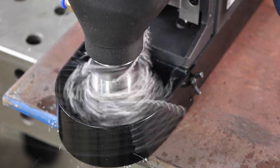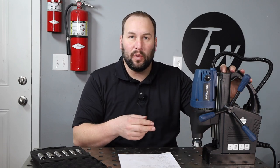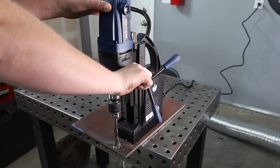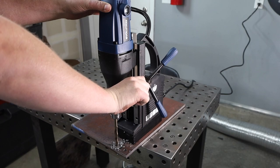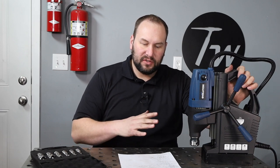If you do want to use a standard twist drill bit, you can put a drill chuck on a magnetic drill. This one actually comes with one to install a regular twist drill, and that works really well too. It also just gives you a lot of portability — a lot of times parts are so big you can't even take them to a drill press, or it's just easier to take the drill press to the part than the other way around. So they're super useful for that.